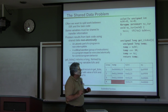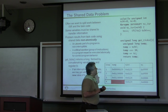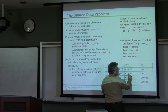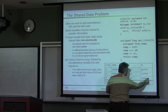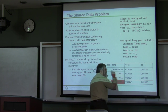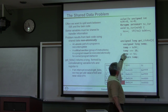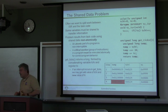The problem comes down to when you are using it. If we're trying to get the number of timer ticks, remember we're only able to get 16 bits at a time. We want to make sure to grab both TC and TC-high at the same time. I would think this entire process would be atomic — during this time, I would not want to be interrupted. Here's the problem we'll see if it is interrupted. Let's go step by step.